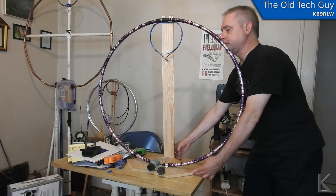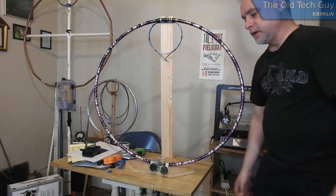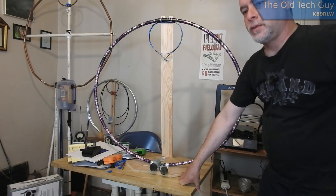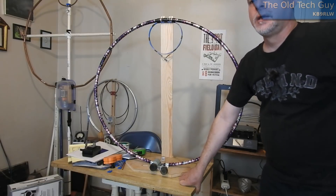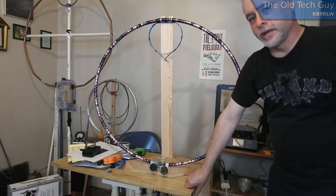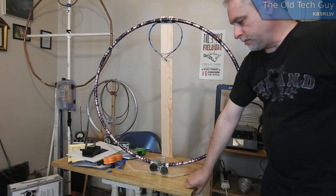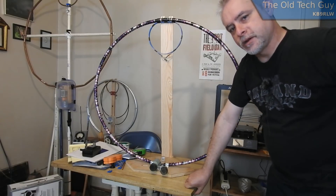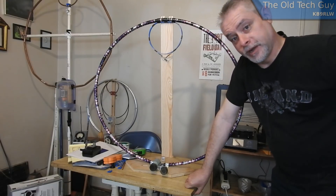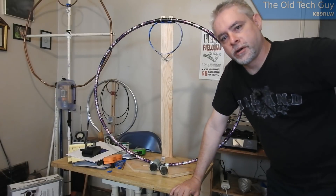The loop is presently hooked up to the Yaesu FT-817 and I've been doing WSPR transmissions for about an hour. Looking at the map on 20 meters - it's early morning so 20 isn't quite open yet - but I'm getting down into Texas, up into Minnesota, and out to the East Coast, all at 500 milliwatts with the loop here in the room. I'm pretty happy with that. I'm going to do some more playing around later today with PSK, maybe try to make a sideband or CW contact, but I think it's going to work fine for QRP night.